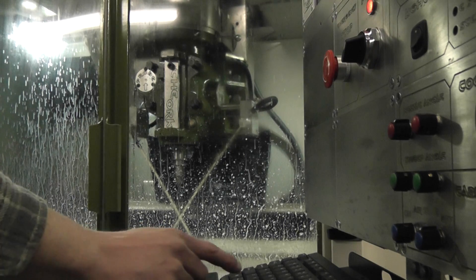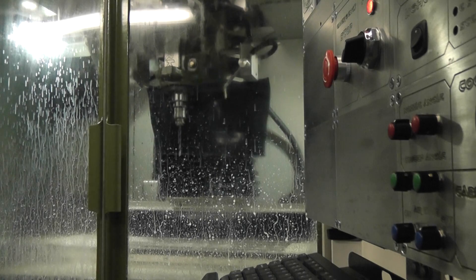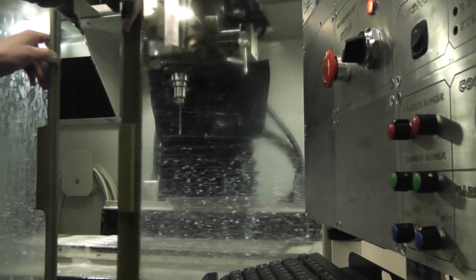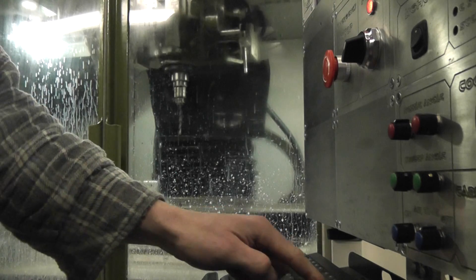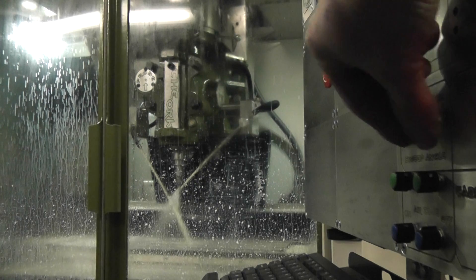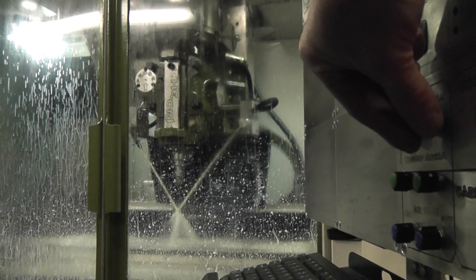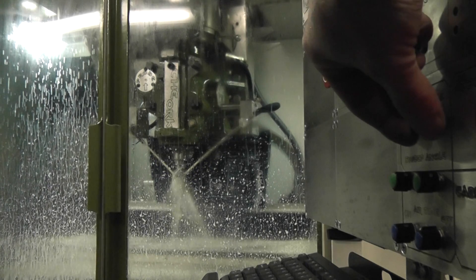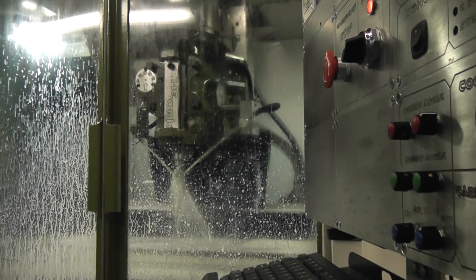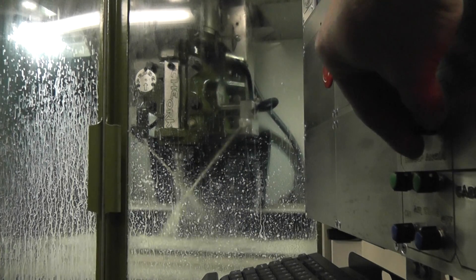If I do a tool change, I'm going to change the tool. You can go back and adjust — with a short tool all the way up there, that's the maximum. That's the extreme stop end of the servo, so the servos won't go any farther than that. It's a physical stop so I don't run it up into the top of the mill. That's 60 degrees — more than enough. These are 180-degree servos so there's plenty of range.